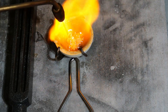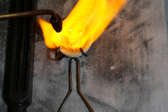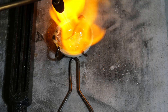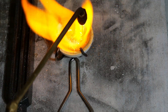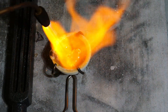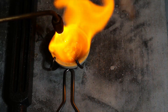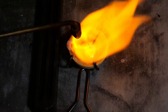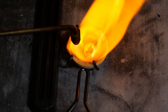The way I like to mix is the jiggle method — I don't like using a stirring rod because that cools the metal down. You're waiting for it to be like a bowl of mercury, completely round and moving in the bottom of the crucible. It's quite lumpy still — almost there, but you can see it's slightly lumpy and starting to ball up and drift off to the side.